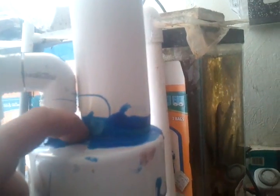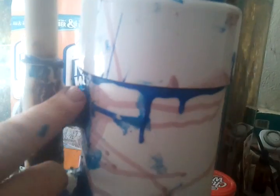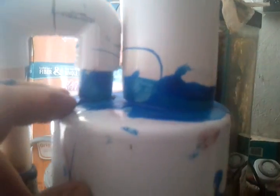Here's what I did: I drilled an 11/16 inch hole here. I'm sorry, I don't remember what I drilled for the 2-inch. The pipe wouldn't actually go through the holes I drilled. So what I did was I heated the pipes up, and I stuffed them in, and when they cooled, they were really solid. I mean, they were tight. And I discovered when I was putting in the top ones that you don't really have to heat the pipe up. If you heat the top surface up, they'll push in just the same. It's actually easier to do it that way, because the surface will bend to your pipe rather than trying to stuff a pipe in, which I actually had to use something to push against the sides to make it go in. So there's a little hint if you get around to wanting to build one of these.